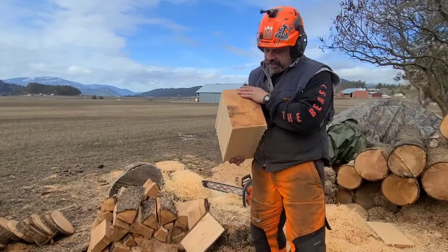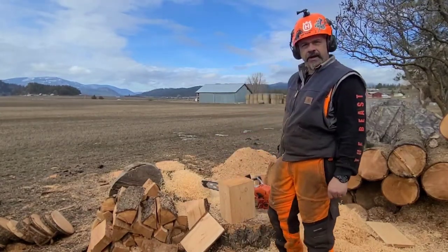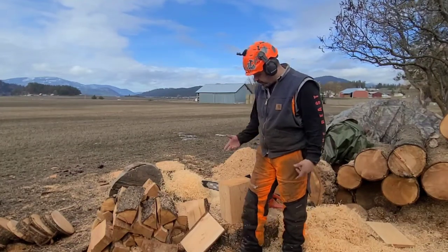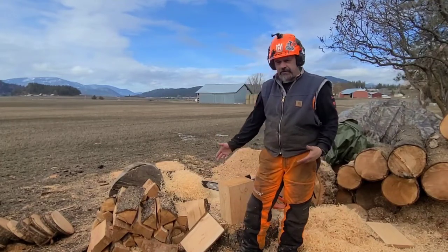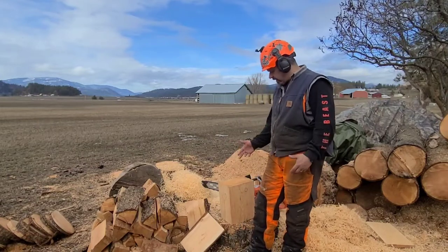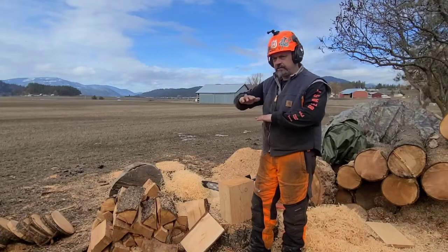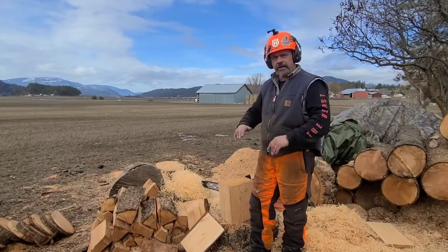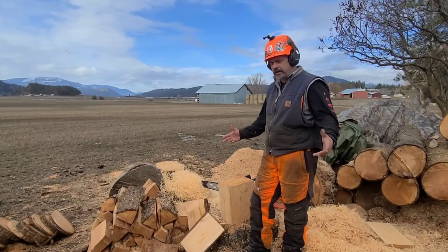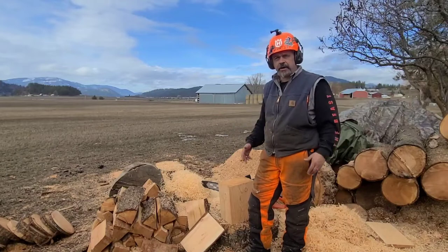But this is the pitch line all the way up this piece of wood, all the way up. So that's why this particular tree, in my opinion, makes better firewood than it would to mill it, because you already lose the outside. You can use the rough cut stuff for paneling on fences and all that kind of stuff. But as far as being able to cut around and get to the heartwood, then you're starting over and cutting more slabs off to get something square to cut with the mill. Well, hope it makes sense. Just a little explanation, a little demonstration for the folks out there that wonder about why I cut it for firewood instead of lumber. That's one reason.